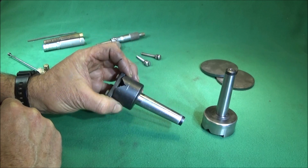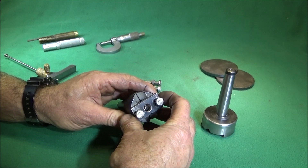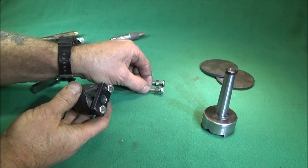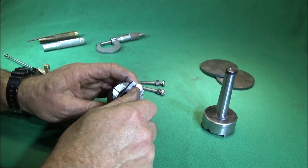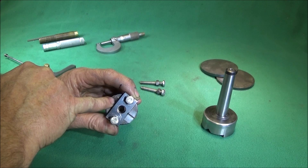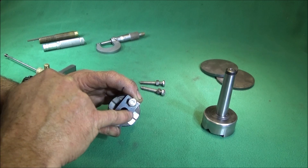They're clamped in there for drilling, tapping, and machining. When you buy this tool it comes with two short bolts, which is alright for doing small bars and components. If you want to do anything larger then you have to fit a couple of longer screws — they're 6mm thread and I've got some nice stainless steel ones. The diameter of the hole down through was only 8mm when I bought it, and I needed to do some bigger work, so I drilled mine out to 10mm in diameter.